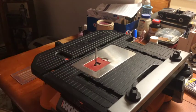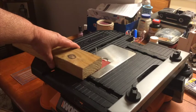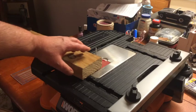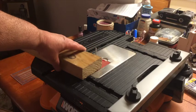The rate of speed is very important when cutting a thicker piece of wood such as a 2x4. You need to go slow and let the blade do the work, because if you don't, it's going to deflect as the blade heats up and as you push it through.